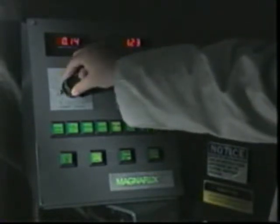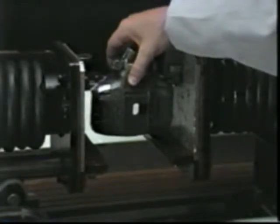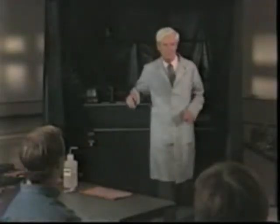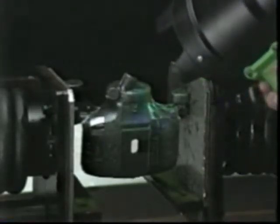We now set the contact and coil current levels based on our best guess, using formulas and past experience. We are now ready for our first try. Do we have enough head shot and coil current to bring out defects in both directions in all critical areas? For the QQIs to work properly, we must use the continuous method. You should also know that whenever we use multi-directional magnetizing, the continuous method is also a must.